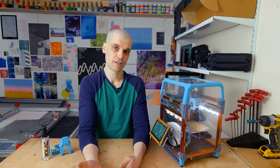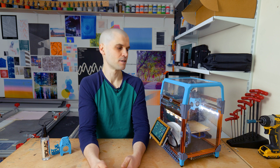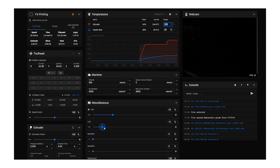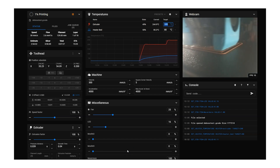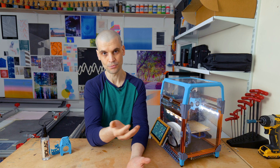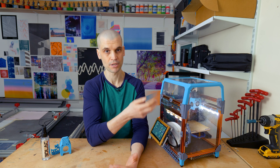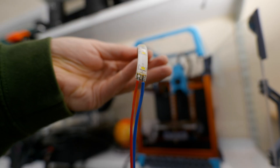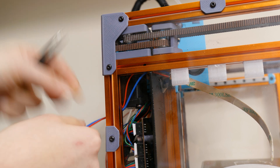The other thing you'll probably realize if you're using a webcam is that you need a little more light in this enclosure. If you've got the printer in a spare room on a shelf like I do, the light isn't great, and at night you can't see anything. The LEDs illuminate the enclosure and allow you to view the print on the webcam much better. I'm using some spare 12-volt LED strips I had lying around, just soldered at the ends.